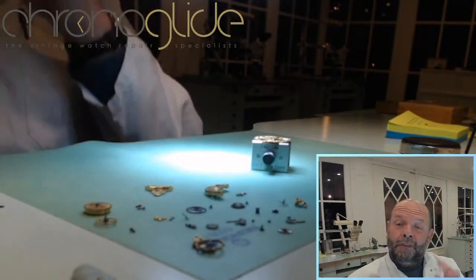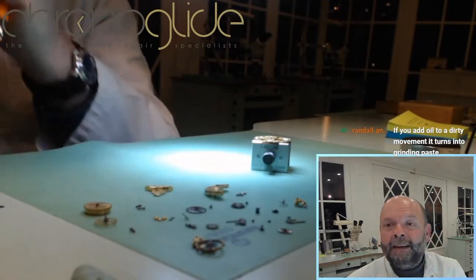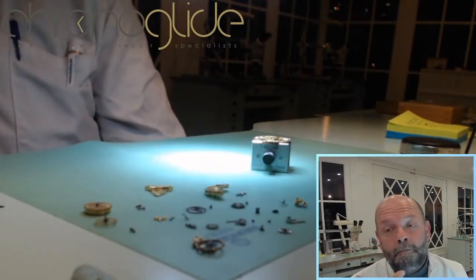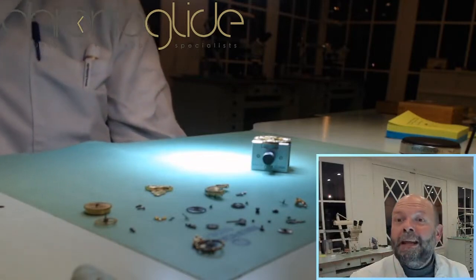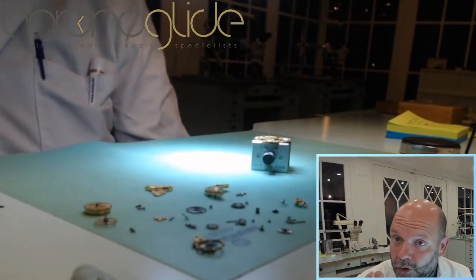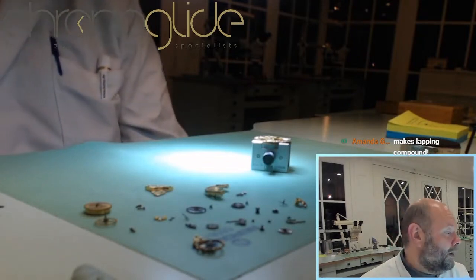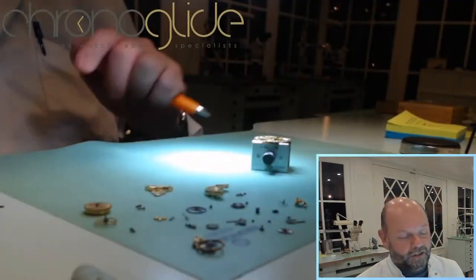With hammer time you push back the material — make it too small, make it straight and back to the right size again — and the metal flakes and horrible grinding debris get flattened back in. But the best way is fresh material: make an oversized hole, place in blank brass material, use a jig borer to locate the exact position of the original hole to the micron, drill a new hole, and make the oil reservoir. That is the best way of doing it. If you're a lazy watchmaker and don't clean your watch parts, you are killing the watch.